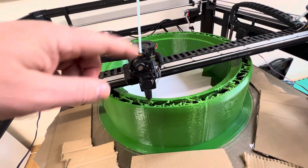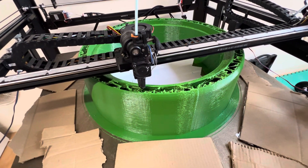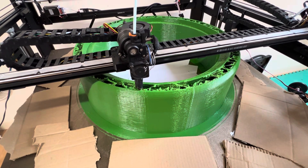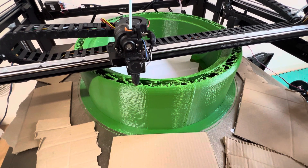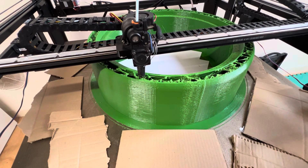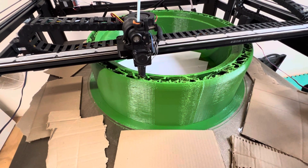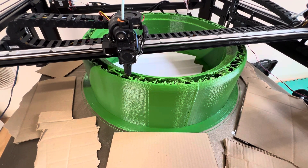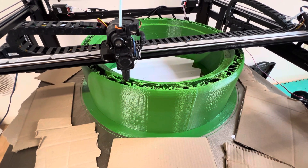You can probably see the over-extrusion on this lip — there's another part that sits in on that lip, so I only put one top wall on it, and it's quite deliberately over-extruded and chunky for strength. Overall as a structural approach, over-extruding that lightning infill is working really well for me. We'll see how it ends up in a minute — alright, that's about enough.